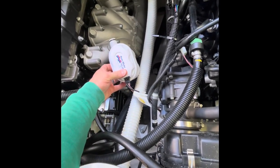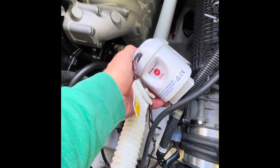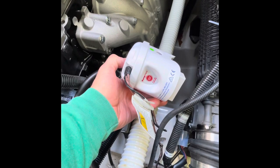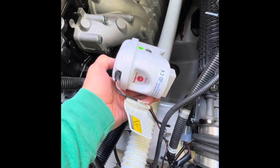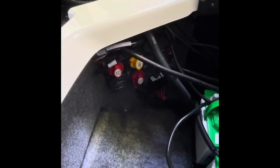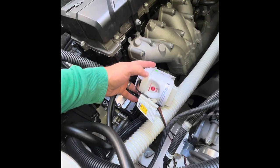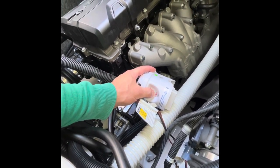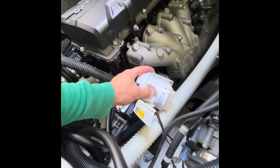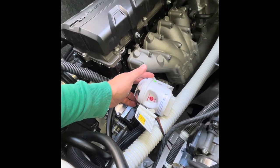We've got the bilge pump here and when I pulled it out I saw there's a pump check option — push and hold for five seconds and it will verify that the pump is getting power and running. The switches are all off and I'm getting solar charge right now because it's sunny in the driveway, but we'll go back to the pump and try this out. There we go, that guy's running and we have no battery power applied from the switch.